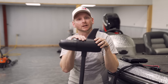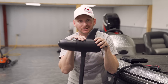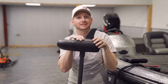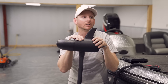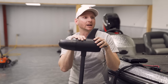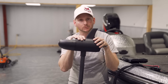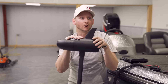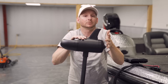From our testing running at wide open — basically 10 on the dial — you're about 40% more efficient. When you back it down to 60% of your thrust, you're actually 60% more efficient. So guys whose batteries wear out in about 10 hours will now get about 16 hours. For those fishing way up north with 15-16 hours of daylight, you'll stay out longer without charging, and back-to-back fishing days won't require as long on the charger.